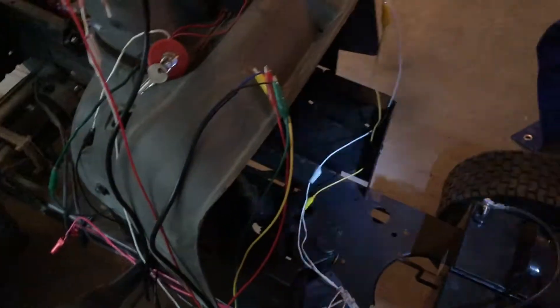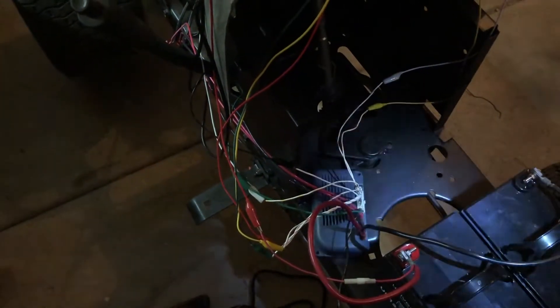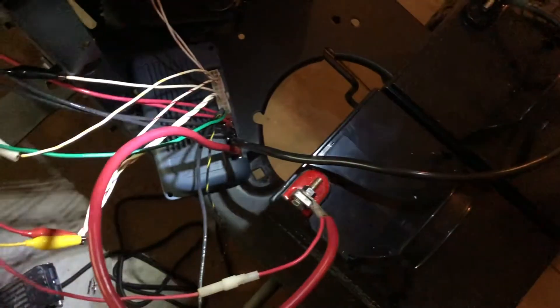The programmer is like $500 or something in that range. So one of the first things I actually had to do was get all this wiring figured out. I used these little alligator clamps, as you see here in the video, and I connected them to the right pins on the motor controller — to the battery, to the switches, to the battery indicator light, to the on-off switch, the key. There were like two or three pins I wasn't positive on and had to reverse some of them. The throttle has three pins coming out of it and I had to switch all three until I got the right order. There's a lot of trial and error that goes along with this — but that's half the fun of building something from your garage.